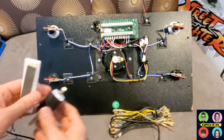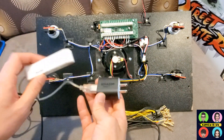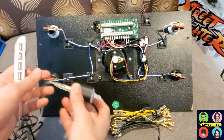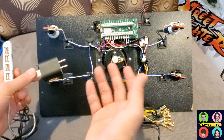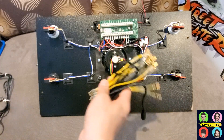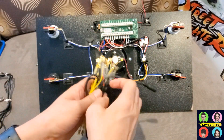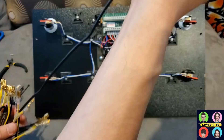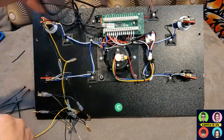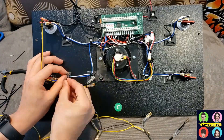The buttons are rated for 12 volts. I did learn that even though the USB brick lights up the buttons, it's only a 5-volt power source — so it lights everything up at a lower wattage, drawing less power and not as bright. The 12-volt adapter for the power wire harness works perfectly. I start on the top left adding an anchor and use zip ties to tie down the wires as I plug them into each button.